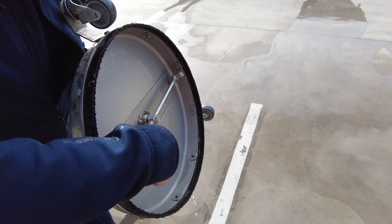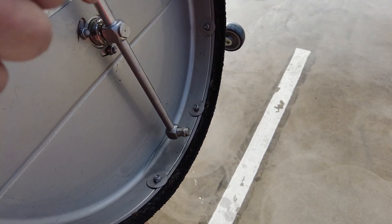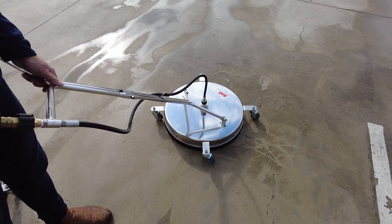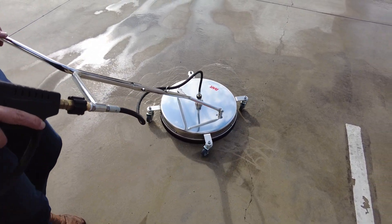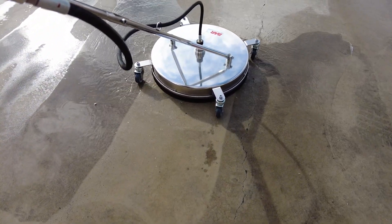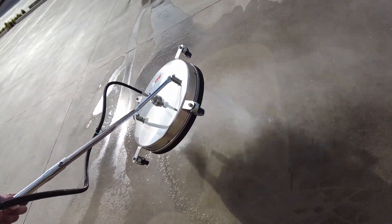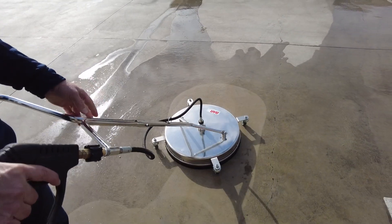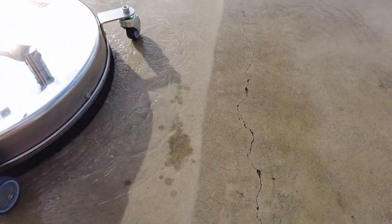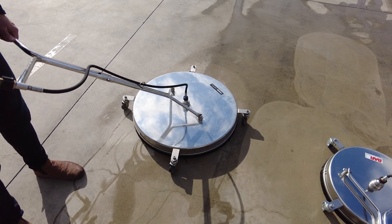Here's a tech tip: when it winds down, place each individual tip at the bottom to check that it's not blocked and you've got adequate water flow. Now on the 21 inch surface cleaner with 3000 PSI / 21 litres a minute — we're really going to see performance gains with that extra flow and that extra six litres a minute. Last of all, the 30 inch — 750 mm — at 3000 PSI / 21 litres a minute.